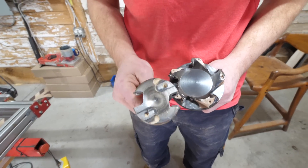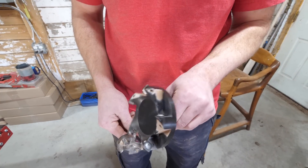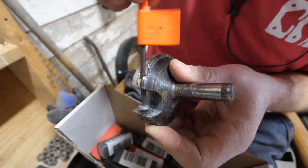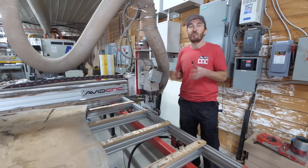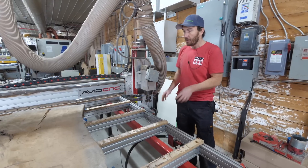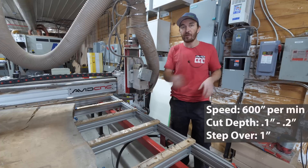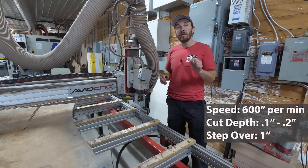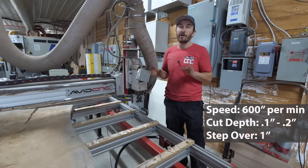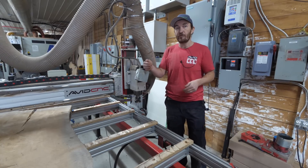The RC2259 leaves an extreme, great finish — we've put tens of thousands of board feet through this bit and it turns out fantastic. The head I currently have is almost not enough power to run this head properly, so I'm very excited to see the results with the new spindle. Inserts are changed — they are four-sided so you can get four uses out of each, but if it's shattered you can't always turn it. We move this machine at typically full speed, just over 600 inches per minute, almost always cutting with the grain. We're usually taking 0.1 to 0.2 of an inch in thickness, with a depth cut of 0.2 inches and a step over of one inch.